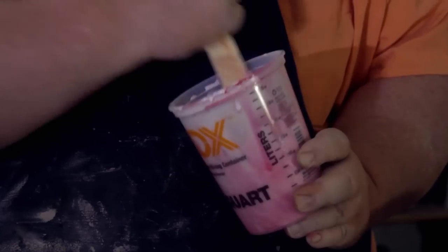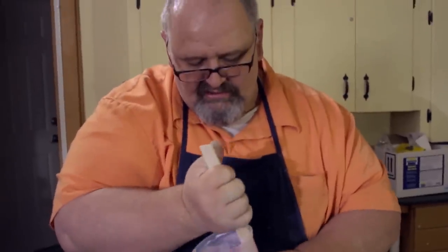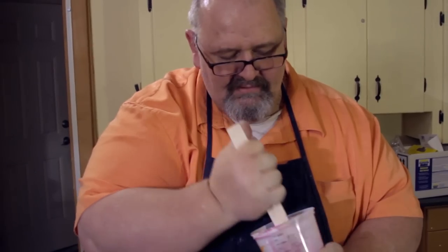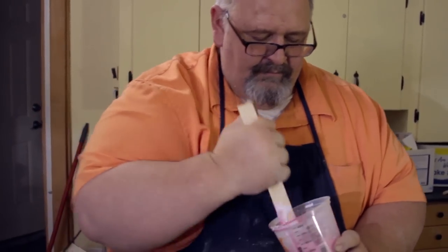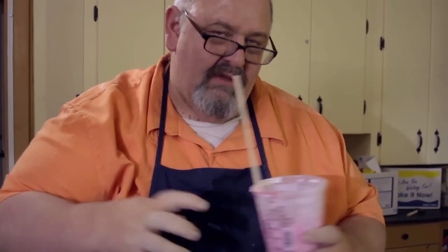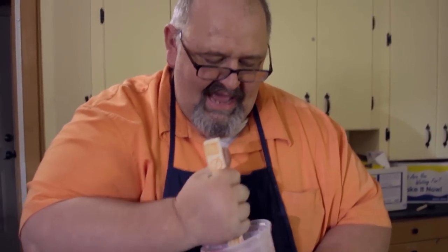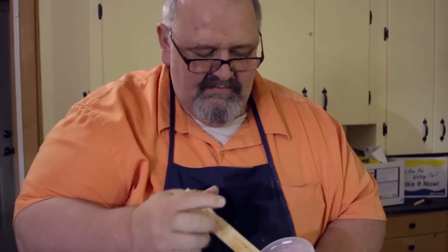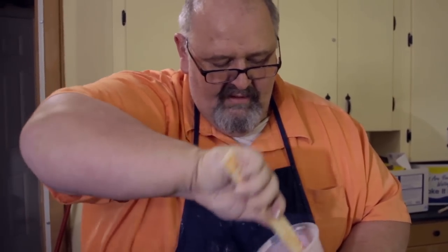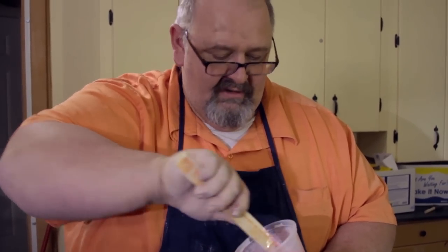There's several different kinds of silicone that you can buy. I mentioned it before, platinum based silicone, which is really good stuff, and also the tin based silicones. The platinums tend to be a little bit more expensive, and there's variations in how well they stretch, how long they last, and the speed at which they begin to cure. There's just a gob of variations from one to another.